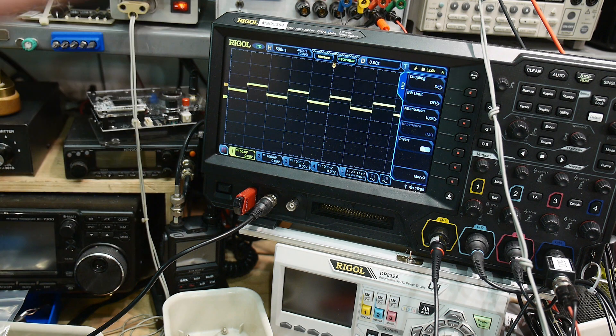The negative Y plate looks about the same, so the Y plate looks to be good. I want to look at the X plate next. I think we're having problems with our Z channel, or the tube is just dead — but I don't think the tube is dead because there's a little orange light in the back. If the tube had lost vacuum, the heater would just burn out being exposed to oxygen. So I think everything might still be okay — it's either the high voltage transformer that blew itself out, or maybe just a transistor blowing up. It was a nasty little pop.